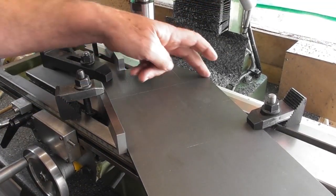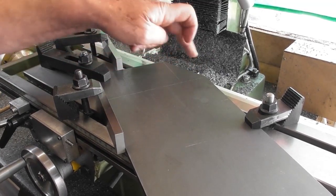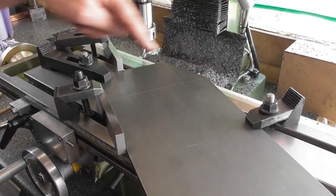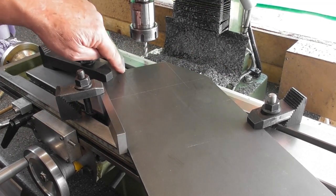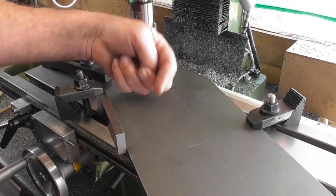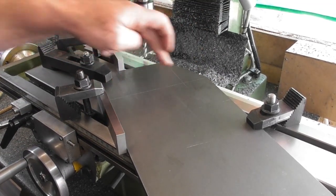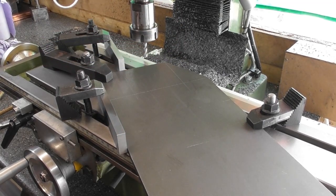So I've just chopped this corner off as you can see. I marked out the plate to dimensions that I've got on a drawing and that's pretty much on finished size. Because I've got this plate set up at the angle, I've clamped it down here and here — which is more than rigid enough. I've set an end stop clamp down on the end and a stop on the side. So if I flip it over 180 degrees this way I should be able to machine to the same reading and get the equal angle — it is equal about — so it just saves setting up and clocking up.